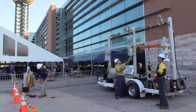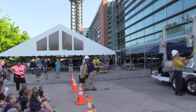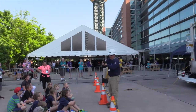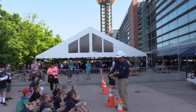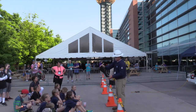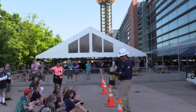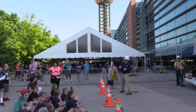While they're setting up for the next part, I'll talk about their gloves and sleeves. We test these gloves every time before we put them on. Before using a glove, we do an air test — we roll it and listen for air leaks. A pinhole in this glove will kill us. The glove has two colors: 20% black and 80% red. When it wears down and shows through, we take it out of service. This glove is tested every six months at 20,000 volts. The sleeves are just for incidental contact — brushing against something — they can't be used to work on the line.